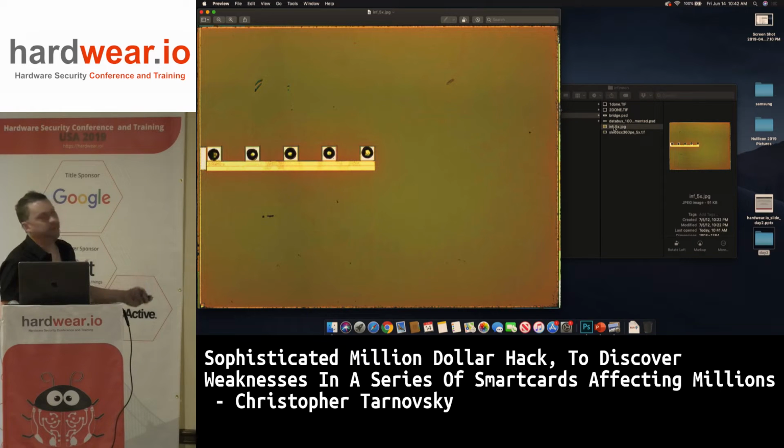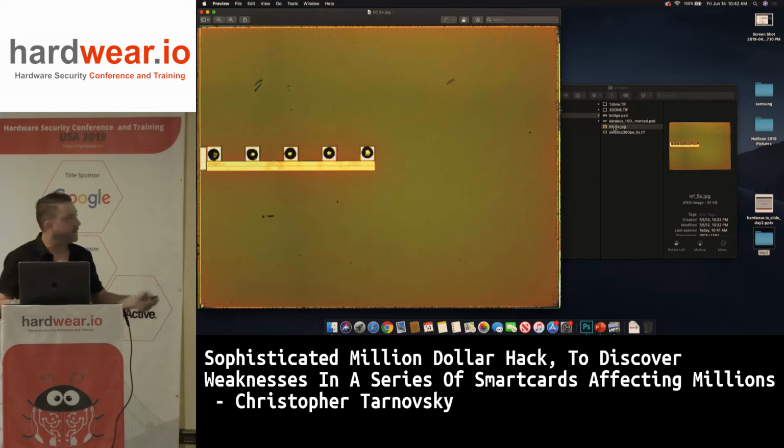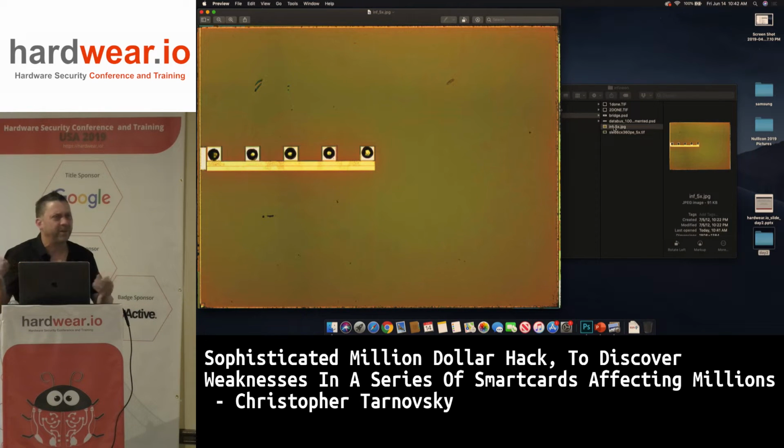Now, Infineon did something really neat. I've never seen this before. They put their bond pads in the middle. I heard from a guy that works at Infineon that the reason for the bond pad layout like this in the middle of the chip, because there's a shield all over here. This is all shielding, and if you mess the shield up, the chip's dead. But he told me it was for, what's that called, bump process or something? Where the balls are flipped upside down on the package. It's for packaging, bump, something like that.